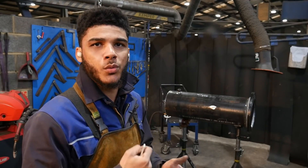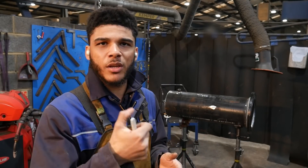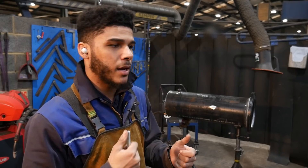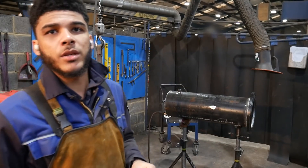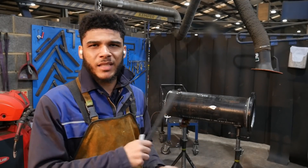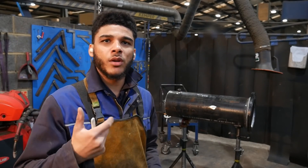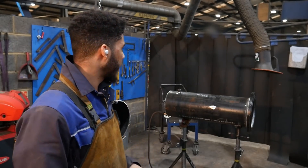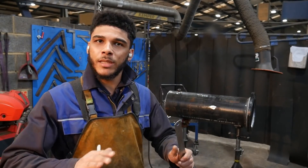The way I'm going to go about welding this: I'm going to have a 3mm gap and root it on short circuit. The cap is going to be pulse somewhere between 160 amps onwards — I'll turn it on and off on the gun as I'm welding depending on how it comes out. I'm going to do two runs. I don't need to do a hot pass because it's schedule 20 pipe, so the pipe's only about 6mm. This is all low pressure, only for heating and ventilation.